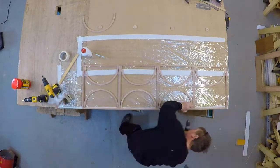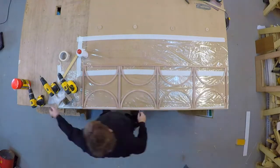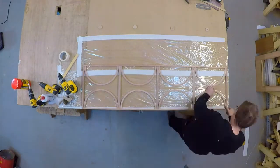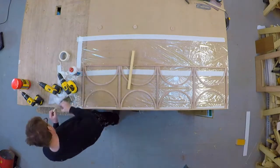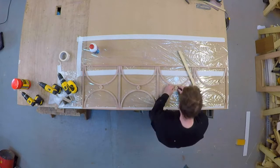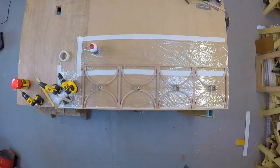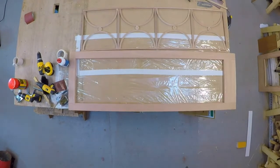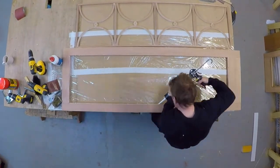When I often measure things out, sometimes it's better to not use a tape measure. Here I'm going to transfer the marks onto a wee stick so that the wee stick's got a mark, and I set the circles to the wee stick. Just leave it to glue for a wee while, and then I can glue it into the actual door itself.